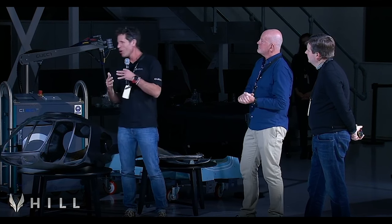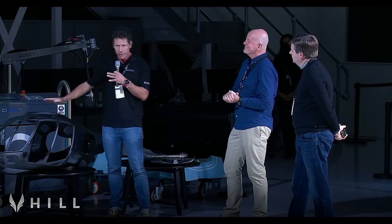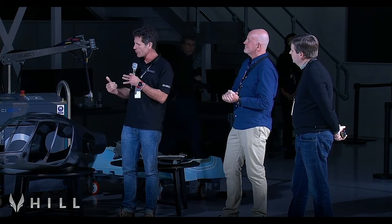Now on Monday, what are we now? A Thursday. On Monday, there was no resin in this component at all. So on Monday, we'd bagged this all up, we checked for vacuum integrity, we'd got it all prepped up, and then this whole assembly went into an oven, because we like to infuse the resin at a warmer temperature. So this is about 40 degrees centigrade.